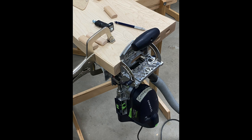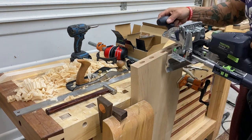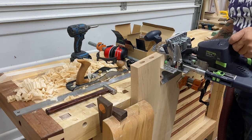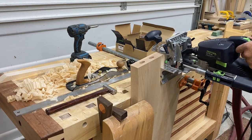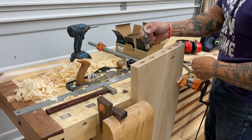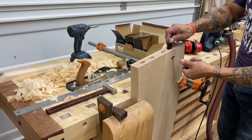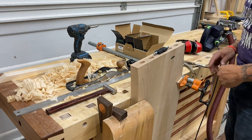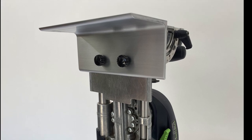Occasionally you'll have to reference a Domino machine off the face of a board rather than its edge, and these 90-degree Domino decks as I call them offer that support — a magnetic clamping pad and vice grip that is very solid, secure, and greatly improves accuracy. I made this first Domino deck for a large maple countertop, posted it on Instagram, and the orders started coming in. The Domino deck fits both the larger DF 700 and the DF 500 — I'll leave a link in the description.